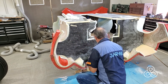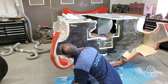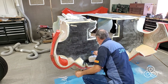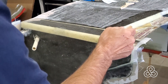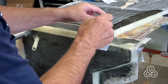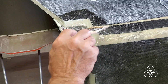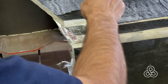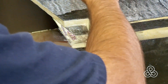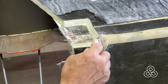With our fabric all laying flat, it's a matter of squeegeeing it out. There are some areas in the corners that still want to stick up. The secret to that is to take some really lightweight satin fabric — satin is another weave that conforms really well to compound surfaces. So I take this two-and-a-half-ounce satin and stick it on the areas that keep popping up. That super thin satin fabric adheres really well to the sticky epoxy and has a little more cohesive strength to hold down the heavier cloth that's trying to spring up. You can take these little corners and put them down, tying all the little loose ends up.